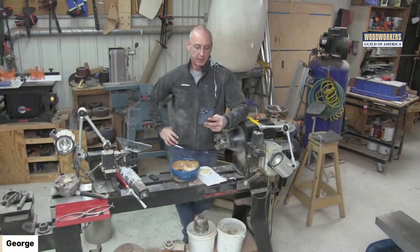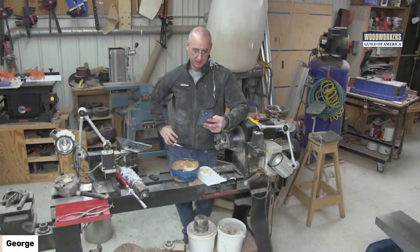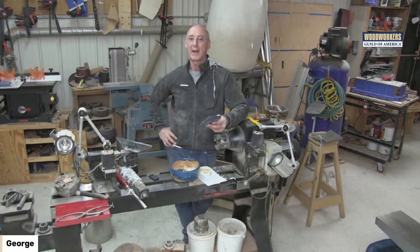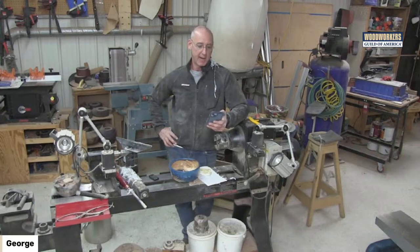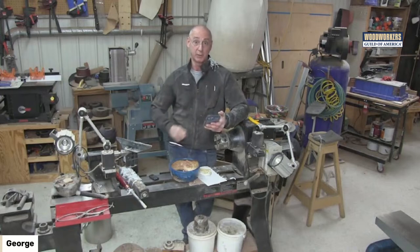John says you have to watch whether the mix is by volume or by weight — this can be very critical. Yes — when doing any epoxy class I say 'read the instructions' probably 200 times in 10 minutes. When it says three-to-one by volume, that's three ounces to one ounce by volume — different from three ounces to one ounce by weight. You need to know whether to use metered cups to mix by volume or a scale to weigh by weight. If you get that wrong, you're going to have $50 worth of epoxy in a bowl blank that won't cure right.